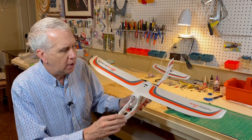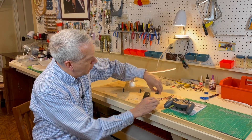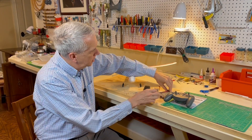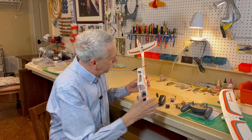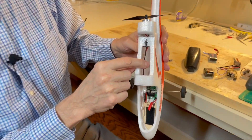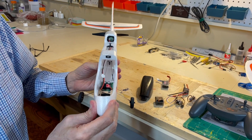So what I'm going to do in this video is take out these electronics and put in a new receiver, lipo battery, two small servos, and an electronic speed controller to see if we can get the model flying with enough control throw. This is a good exercise in model building - if you get a model at a swap meet or somebody crashes in a field, being able to take out the existing electronics and put in new motor electronics is a useful skill, especially with these almost ready-to-fly models. There's a fair amount of space, and even when you take off the wing there's a lot of space inside. The foam is EPP foam, which is very tough and rigid.